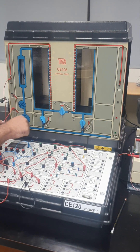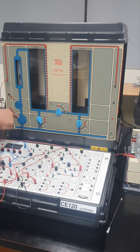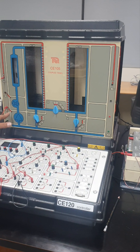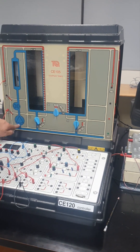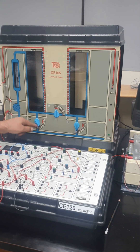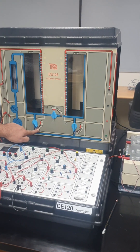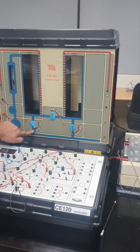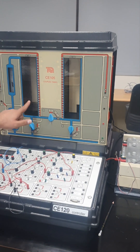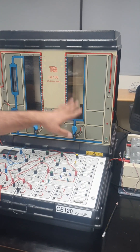This is a pump, and the arrow going inside means it needs voltage input. We are going to supply voltage to this pump using our PID controller, which we will discuss afterwards. The blue thing is water. There is a valve — at 3 it's more open, at 0 it's fully closed, and at 5 it's fully open. The other two valves are not being used; one is for transfer to the other tank which is closed, and there is no water on that side.